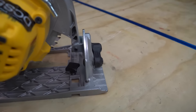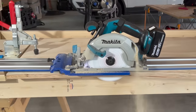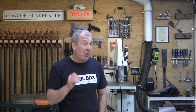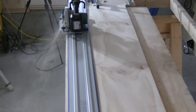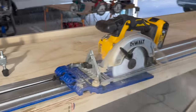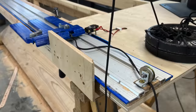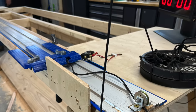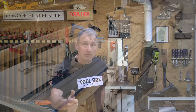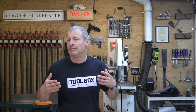Let's move on to performance testing — this was fun. We looked at power, speed, blade rotational speed, number and size of teeth, motor torque, and horizontal force applied — all of which influence how quickly a circular saw cuts through material. To minimize cutting variables, we put the same blade on every saw and used consistent three-quarter inch AC plywood as our cutting material, eliminating the human horizontal pushing component entirely.